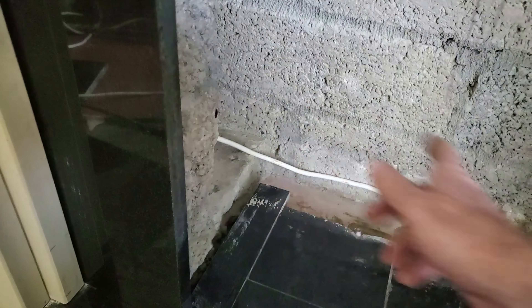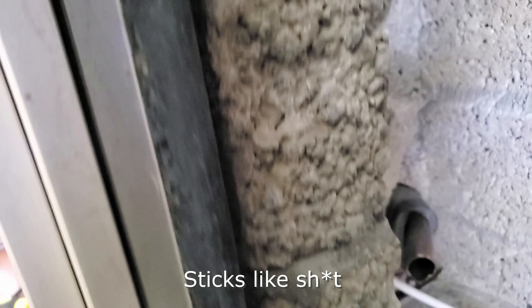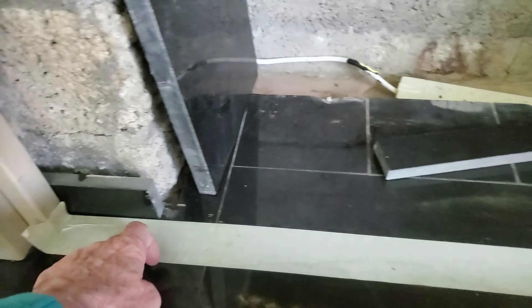I'll let that sit in there. When I put on these slabs they need to come out as far as they go, so you can always get them behind if need be. The flex is tucked up — good job. Now I have to think about what adhesive to use. Spray foam would be ideal but I'm not sure if the sticky spray foam will block the tube after five minutes — I need more than five minutes to position the tiles correctly and get the angles right.